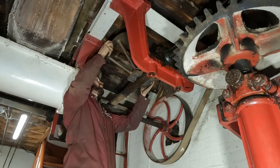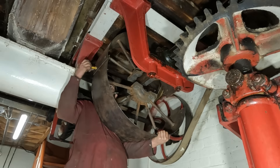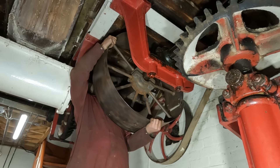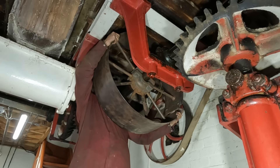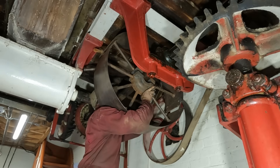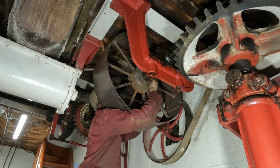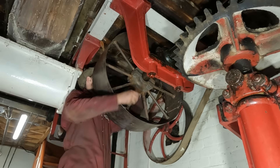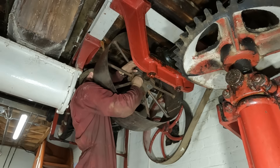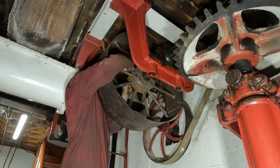With the key seat established it's time to fit the pulley in position. This is where these wrought iron split pulleys really come into their own — lightweight and easy to install onto existing shafting. With the pulley in its final position I can measure the keyway properly and get back to the workshop to mill the key blank to size.